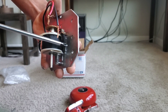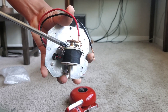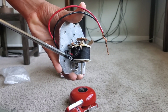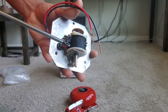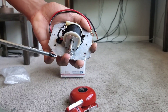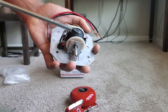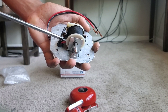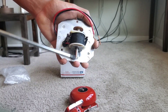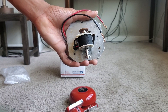The diode is very important. There's the plunger, also known as the striker assembly, and the switching circuit up here with the little spring. The capacitor helps regulate the current a bit better. The screw down here actually adjusts the height of the striker assembly — if your bell is not making good contact or not sounding properly, you just take a Phillips screwdriver and adjust it until the striker reaches and hits the gong properly.